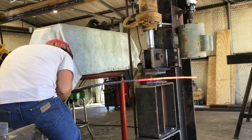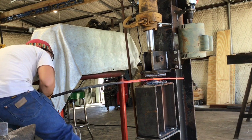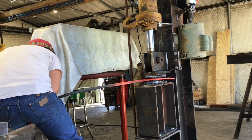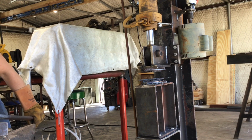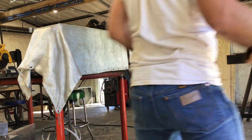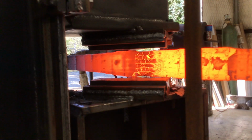Now you remember this Ngombe Ngulu has a big old hook on the end of it, so what I've got to figure in is the radius that I'm going to have out on that hook, which is going to be about 4 to 5 inches is what I've got drawn. So you figure 4 to 5 inches, that hook is almost 2/3 of a complete circle. So you have to figure in, okay, what's 5 times pi or 4 times pi, somewhere in the 12 to 15 inch range for a complete circle. Now we're not using a complete circle, so I'm figuring that I need probably about 10 inches of length to make that hook out on the end. So I'm tapering down at least 10 inches because that hook is a smaller width than the rest of the sword. So that's what I'm doing here.